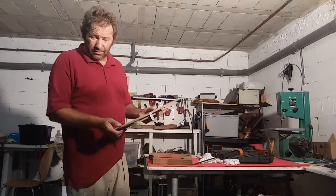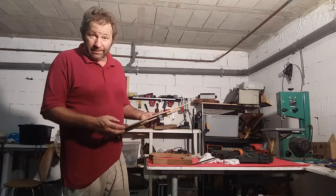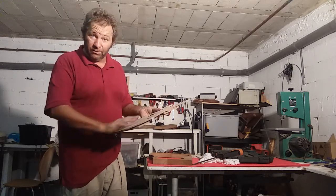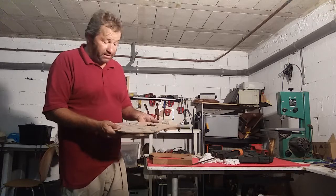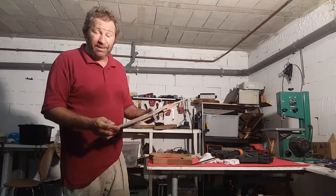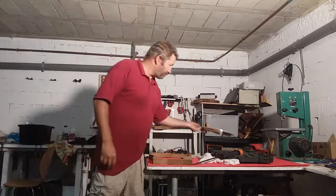I've used MDF, you know. I don't normally use MDF because it's not very good. A good trick for MDF, if you want to make it a bit tougher, is put super glue around the sides, or paint it with polyester resin or epoxy, and that way it'll last a lot longer. It's very easy to make patterns out of. So that's one thing I've been up to.